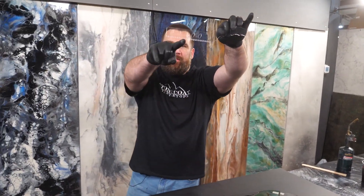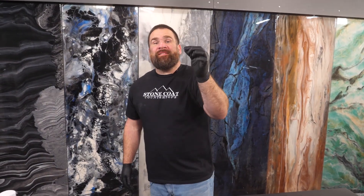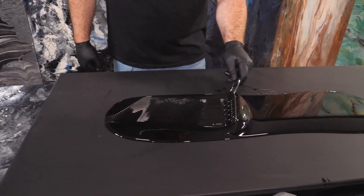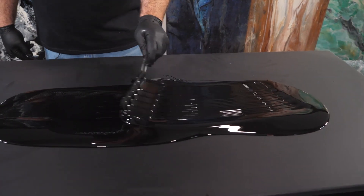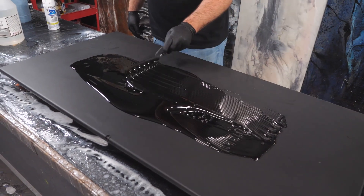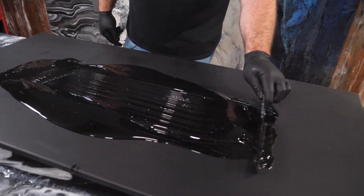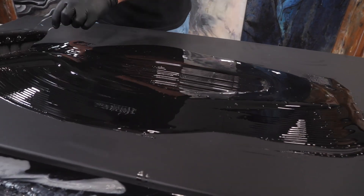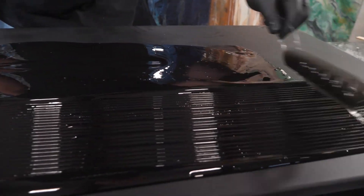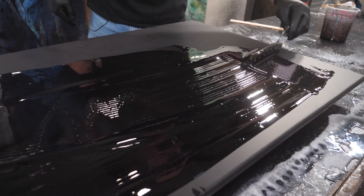This is an eighth inch by eighth inch square notch trowel with a cool little handle. It's also a mixing stick available at stonecoatcountertops.com. First thing I do is take my mass of epoxy and trowel it amongst itself one final time on the surface — just mixing it an additional time. I'm gonna trowel this material out, keeping it away from my edges, and then I'll come back with a chop brush to eliminate any trowel lines.